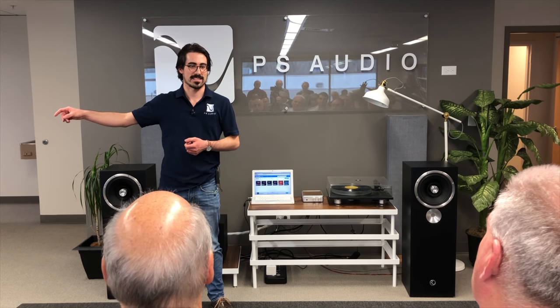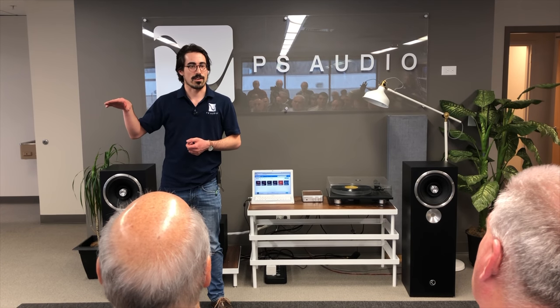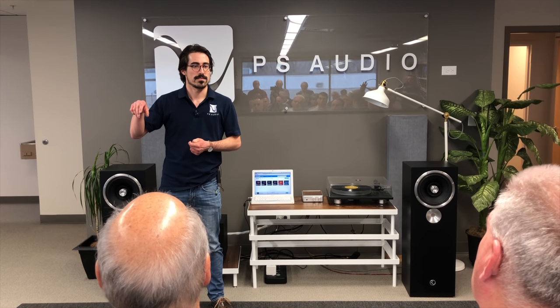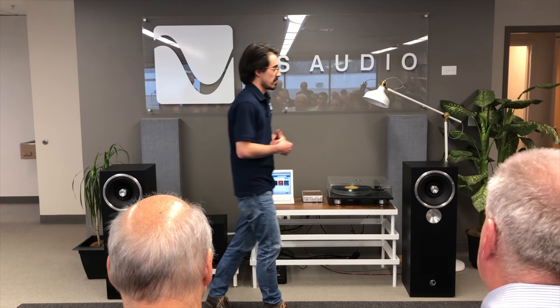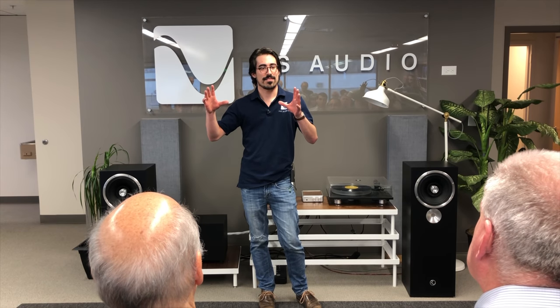Because all the stages that I really like the sound of, if you had an open loop characterization of that, it'd be pretty darn linear compared to these chips. So that was my main goal, to first create a circuit that is really linear with no feedback. Then I'm going to apply feedback to it, because I like feedback. I don't think feedback is the devil or anything. It's that so many amplifiers are using a really non-linear open loop path, and then they're using a lot of feedback, and then they're creating a linear system. So they start off with a very nonlinear system, apply a lot of feedback, and they get the linear system. I want to start off with a linear one and then improve it further.